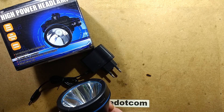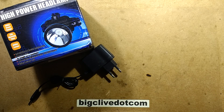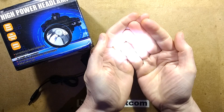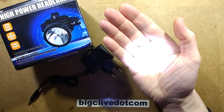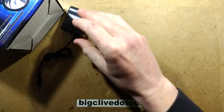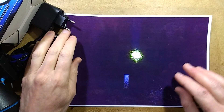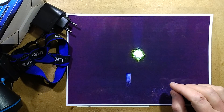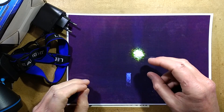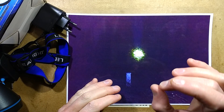It's a very odd type of device. If I put this on and point it at where I'd be working, it produces a really focused point of light — pretty much the size of your palm at a working height. That's not necessarily terribly helpful. When you go outdoors with it, you can barely see foliage because it puts out a very low level of light at the sides. It puts out a bright dot in the distance — at 20 feet it would be a 1-foot diameter dot, at 10 metres it would be 500 millimetres. It's really, really focused.